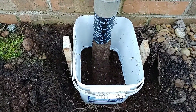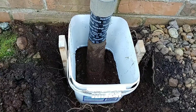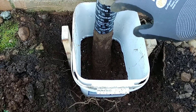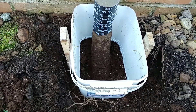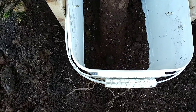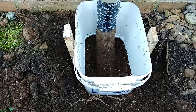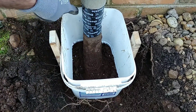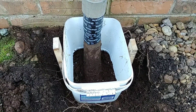Here's what you're aiming for: you've got your bucket around the pipe here. We taped up past the top of the bucket, so our tape is right up in here — we don't want to encase this coupling inside the concrete. We could have gone higher with the bucket, but since there's a coupling here we're just going to stay below that. We've dug down far enough so the concrete will pour out around the sides of the bucket. We'll be able to pull the bucket off after it dries since we've cut the back side of it — it'll just pull apart. So we're going to go ahead and mix up some concrete and fill it up.